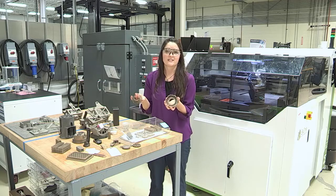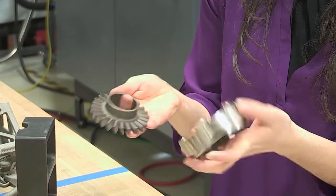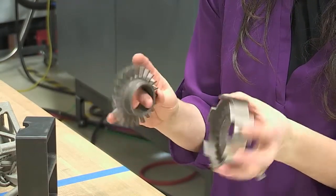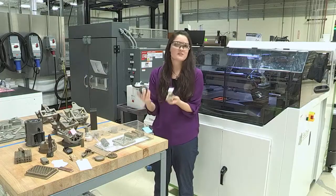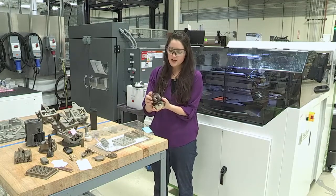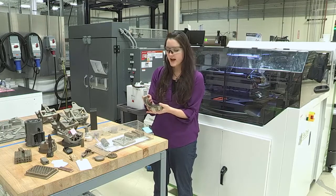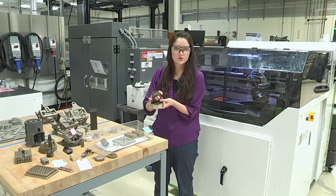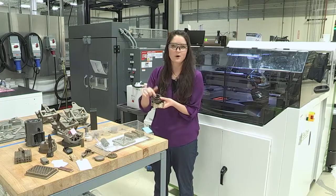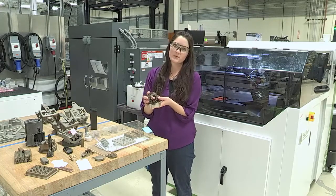That's how we make fully dense metal parts using plain old low-tech inkjet technology. This is a really cool part — it's really difficult to get tools into all of these crevices to get the desired shape. But with additive, this is an easy part to make. With additive, complexity is free. They found that by using this material system instead of tool steel, they actually had an increase of tool lifetime from two weeks to six weeks, because the sand that they were drilling with would get stuck in that bronze matrix and act as a sacrificial wear surface.